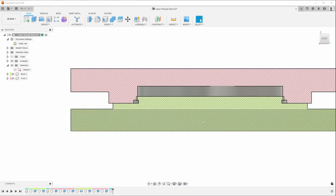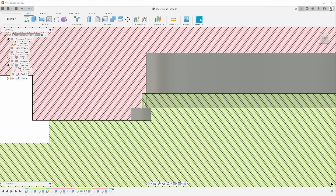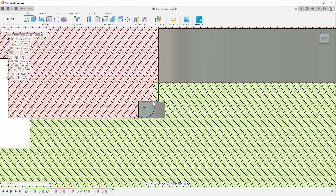I'm showing a cross-section of the test parts. You can see where the threads are — I'm not actually modeling the thread so it looks like interference. I drew a circle 0.7mm in diameter representing the O-ring. You can see the problem: this is the slot I created for it, but when the O-ring is hitting the bottom end of the threaded section, the slot is not wide enough to allow me to push the two halves together. So I'll need to widen this slot, probably to about there, and give it another test.